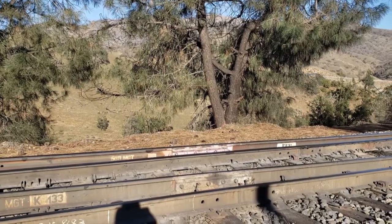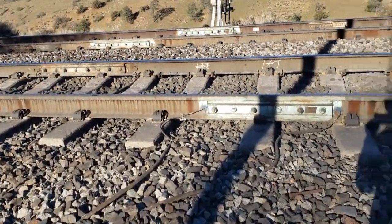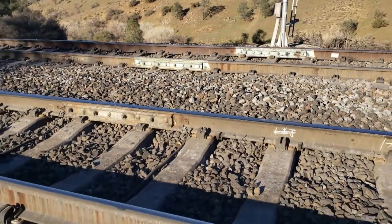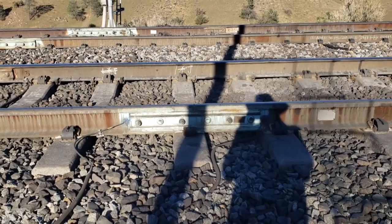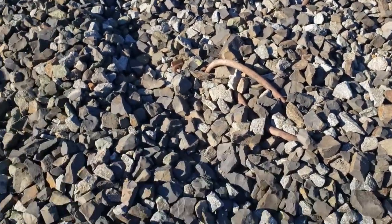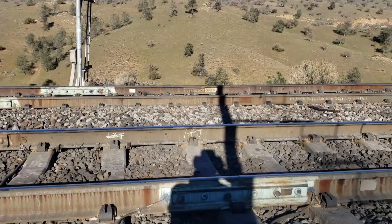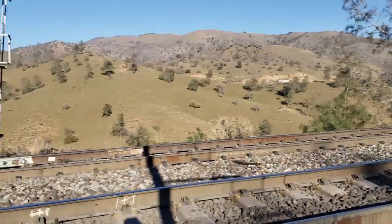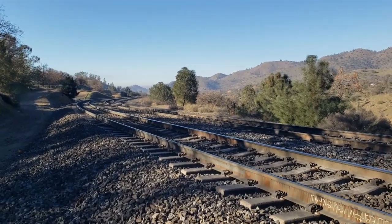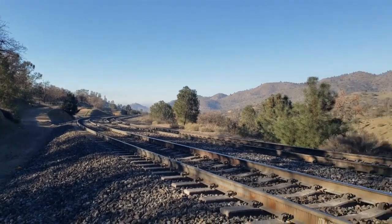We are at the setback signals — the trailing signals — and they do the same thing. These joints are in pretty good shape, relatively new. You can see the track wires plugged in and the bond strand — that wire right there is bond strand, it goes inside these conduit hoses down under there into that junction box and up to the house. This is where the OS track stops and the two main lines begin — number two track on the right, number one on the left. The next signal down where these track circuits would end is at the intermediates between Waylong and Marcel, where we started.